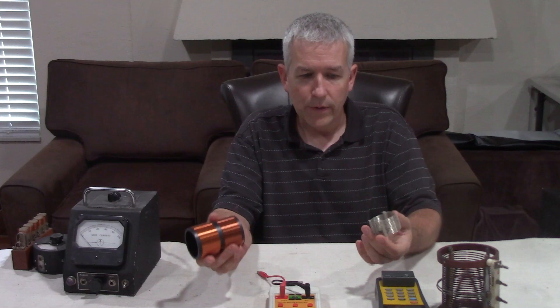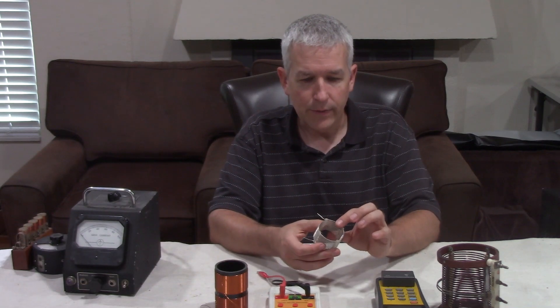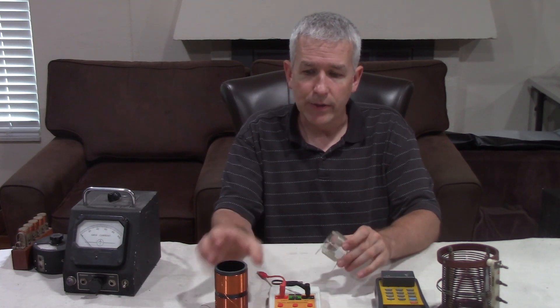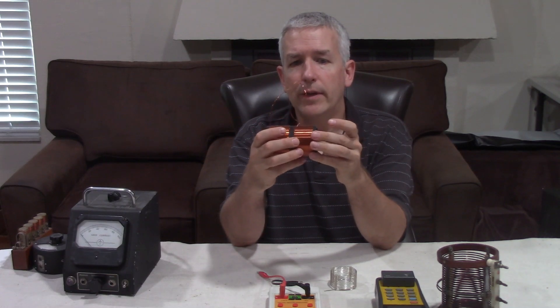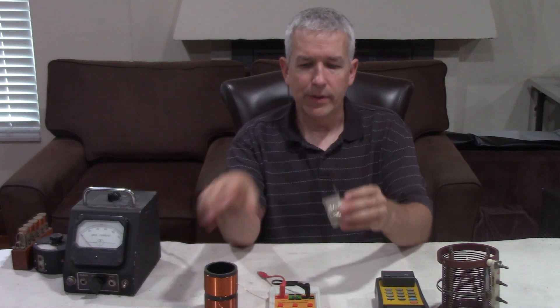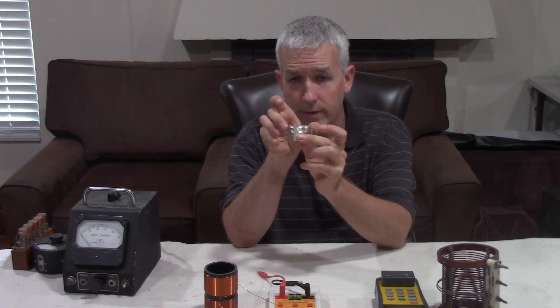If you're wanting to measure a coil like this, type in 'helix coil calculator' and put in your details. Get a measurement of the wire itself — the bare wire, not the insulation — unless you want the coil calculator to include the insulation thickness. You're looking at several parameters: one is the bare copper or tin with no insulation. Then measure the diameter from center of wire to center of wire, not the external dimension.